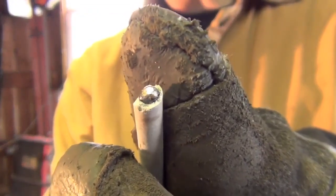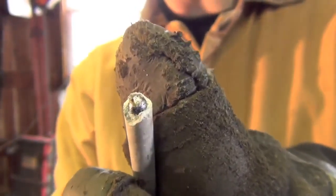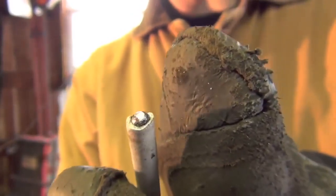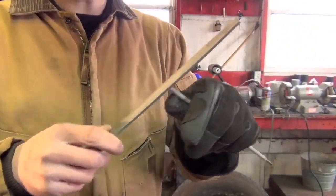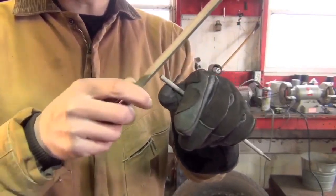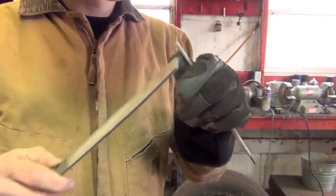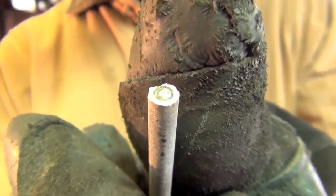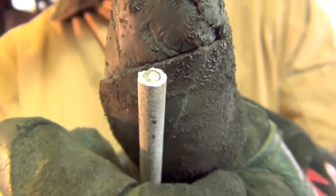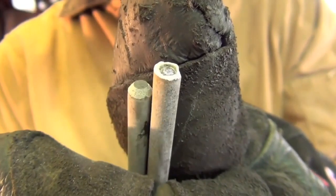No smashing, which could potentially damage the flux. No potentially burning down your shop. That, ladies and gentlemen, is bare steel — it'll arc right to the workpiece. As you can see, the bare steel electrode is now once again level with the flux coating. When we compare this to our brand new electrode, it's pretty much the same concept. That new electrode also has a little bevel or chamfer of some kind on the flux.